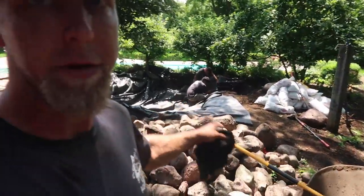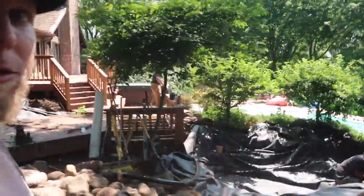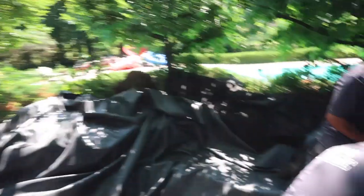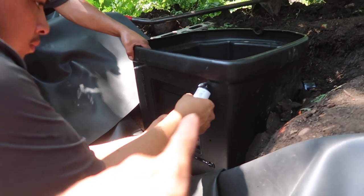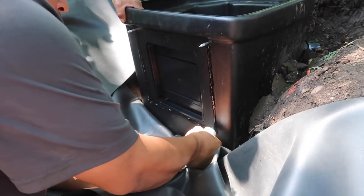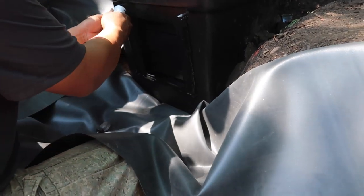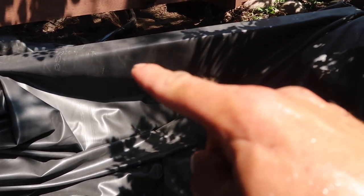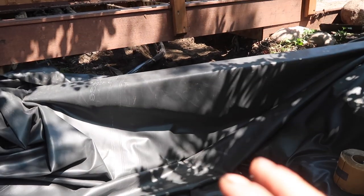We have the liner in, as you can see behind me. Juan and Micho are working on attaching the faceplate to the skimmer box itself. They make a bead of silicone all the way around, attach the liner to the face of the skimmer box, then come through with the faceplate and attach all the screws, making that watertight seal, and then cut the opening in the liner. Meanwhile, because the elevations didn't work out for us to pull off an overlap for a little waterfall coming into the pond on this side, we have to seam some liner together.